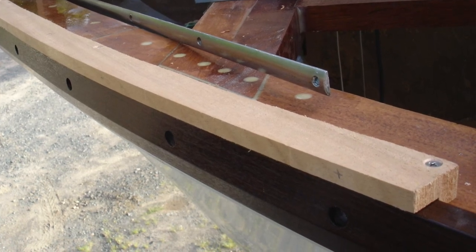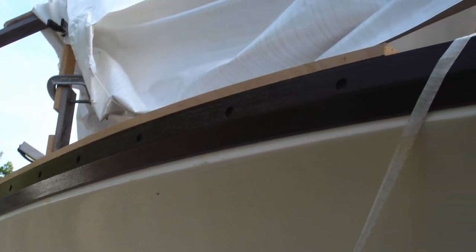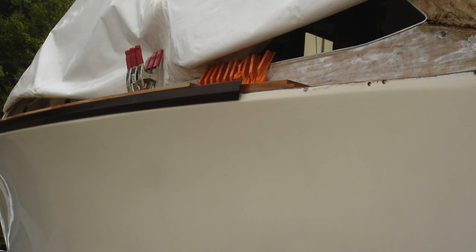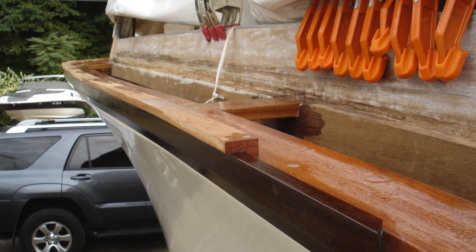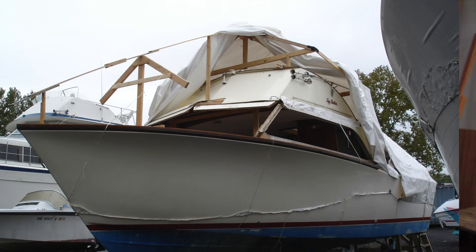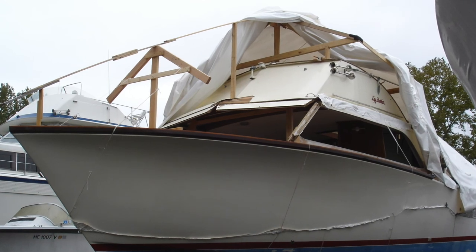So I made these little wood spacer pieces that follow along the whole top of the rub rails. They weren't too hard to fabricate - just used a router and a jigsaw, didn't get too fancy with cutting them, they didn't have to be perfect. I cut the outside edge just like I did with the upper sheer clamp - just routed it after I put it in. And I put a couple coats of penetrating epoxy on just to protect it in case any water made its way through the shrink wrap. I didn't want any of this new work to get ruined.